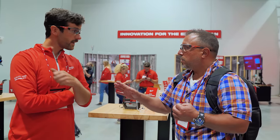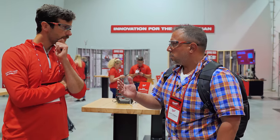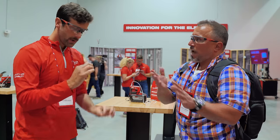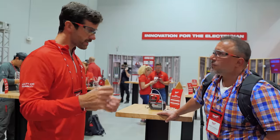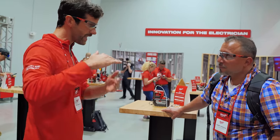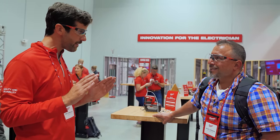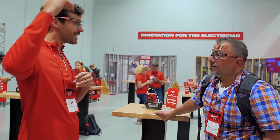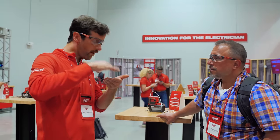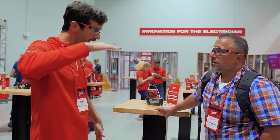Yes, so you're using laser. I'm using laser. Instead of induction heat treat. Think about it — the price of entry has got to be higher for laser. Much higher. But over time — in that lab, remember I handed out those pucks? We cross-section everything we do to make sure our gradient — meaning how far down we heat treat — is precision controlled. The capability of that process is like 10x more capable than the induction process. We're able to dial in that hardness on the cutting edge and the serrations, and that's critical for the life and the cut force.